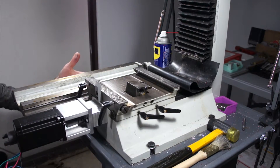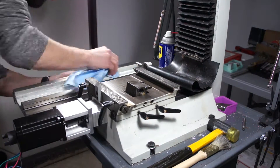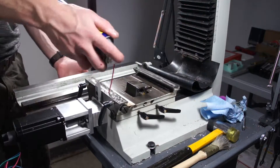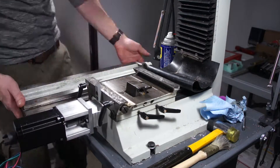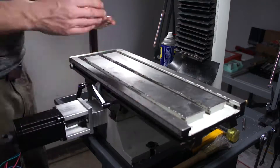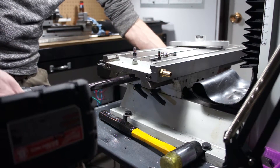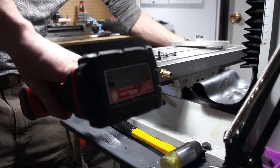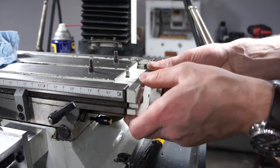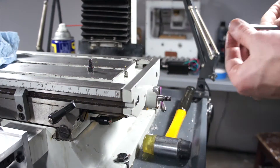With everything adjusted to how I liked it, I'm going to put the table back on. I took some WD-40 basically to clean all the old grease off the milled ways, and then once we have that back aligned we can put the table back on. The gib is still loose so everything goes together quite nicely. Next was putting the lead screw back in using the drill trick again. Then we pound the x-axis end plate back on — there are a couple pins that keep everything aligned and a couple socket head cap screws that lock everything in place.